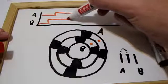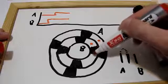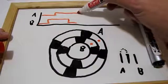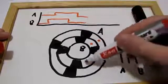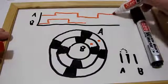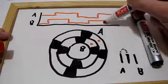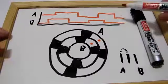But a little later, B goes out of the black area into the white area — it goes down while A is still up. And only then A goes down. Then you're back to the start and it all happens again — the exact same pattern. This is the pattern of a clockwise rotation.